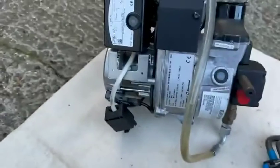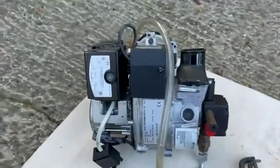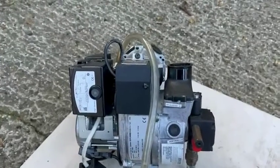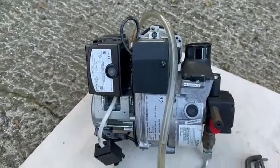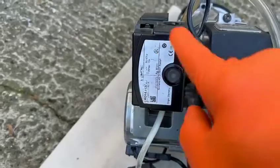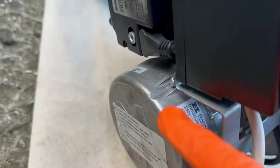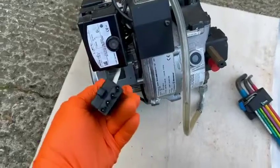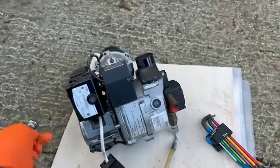Burner removed. So just to explain - this is the Riello burner that HRM put on the Wallstar boilers. Not a bad burner, but we do get a few of them that clag up. The trouble is things are low NOx these days on more modern boilers, and the tolerances are so much tighter, so they have to be set up more precisely. Just a basic overview: you've got your pump and solenoid coil there, your fan is inside here, behind here is your photocell which detects the light, and there's the digital control box and the EBI transformer. There's the motor. And there's the oil line - they're clear on these Wallstars, which is a great idea, because if it's pulling air when it's running you can see it. Really good for diagnosis purposes.